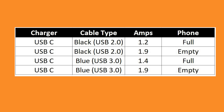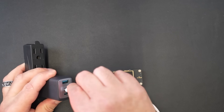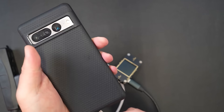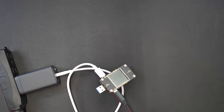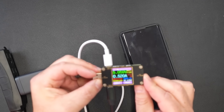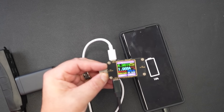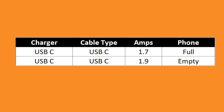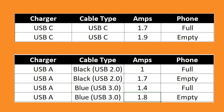What about testing a USB-C port on a charger with a USB-C cable? I plug a USB-C cable into the charger, then into the tester in-port, another USB-C cable out into the phone. Plugging into the TCL almost-dead phone: it starts at 0.5 amps as it boots up, then hits 1.9 amps exactly as before. So using a USB-C charger and USB-C cable makes a big difference over USB-A — 1.7 amps on a nearly full phone and 1.9 amps when almost empty.